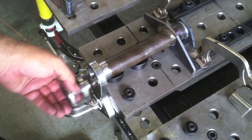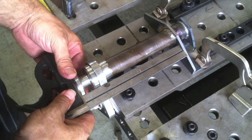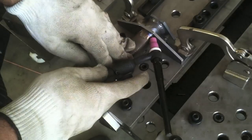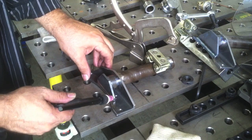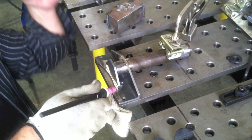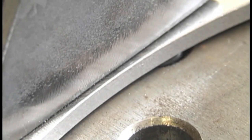Now that I've got that piece welded, I need to tack the rest of it up. I've got to check my dimension — it's supposed to be 7.55 and it's just about 7.55, so I'm ready to go. I'll tack the rest of it and then weld the other end before I weld the heavy plate on the end. Get some tacks on there, then pull it all apart — I've got to weld this run here in addition to both sides of that other weld. I just prop it up near the edge of the table where I can drag my glove and finger along the edge to steady this long run.